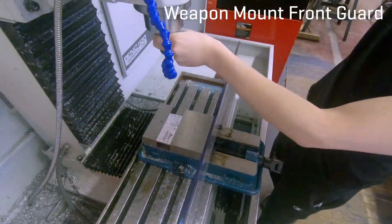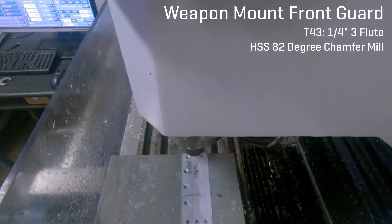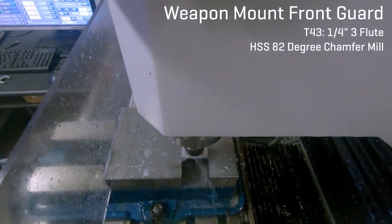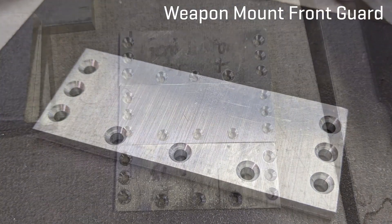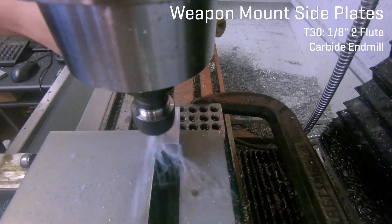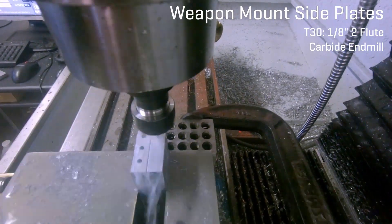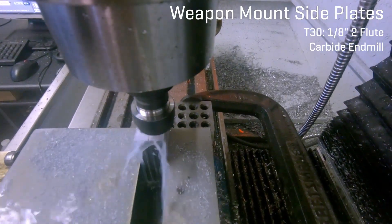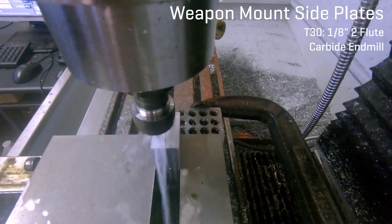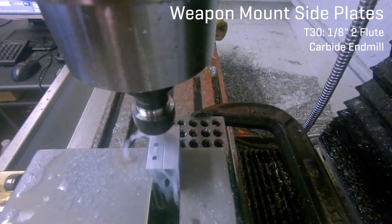In terms of those you'll likely find at a local makerspace, or even entertain purchasing yourself, the $400 3040 China Special, or even a $1,200 to $2,000 Shapeoko is extremely popular among makers and makerspaces alike. The main difference is that you don't get nearly the torque or overall power from a router designed to cut wood that you do on a mill designed to cut metal, and you lose out on the built-in cooling systems that frequent CNC mills, although adding your own mist cooling setup is pretty easy and cheap. You'll also probably lose the ability to have a computerized spindle RPM control, but that's easily compensated for with a $20 tachometer. In fact, the ShopBot Buddy CNC router my makerspace also has can handle aluminum only about as well as the Shapeoko, despite having many more times the cut volume and a 3.3kW spindle, simply because of the lack of cooling. You can do it, it's just much slower than a mill.